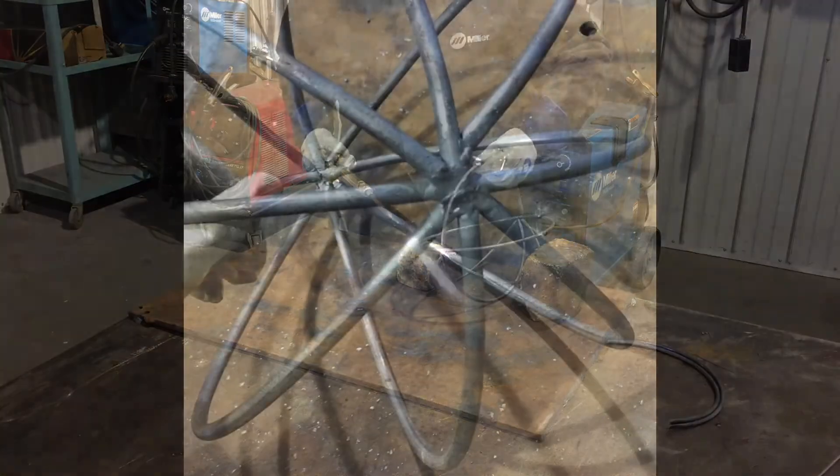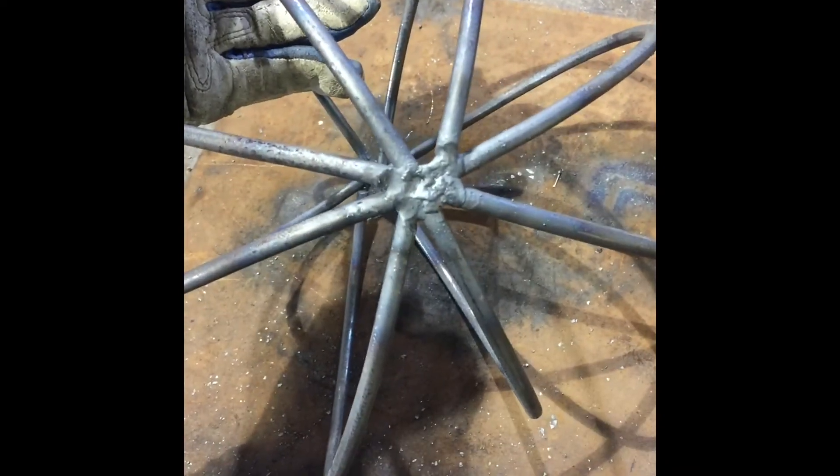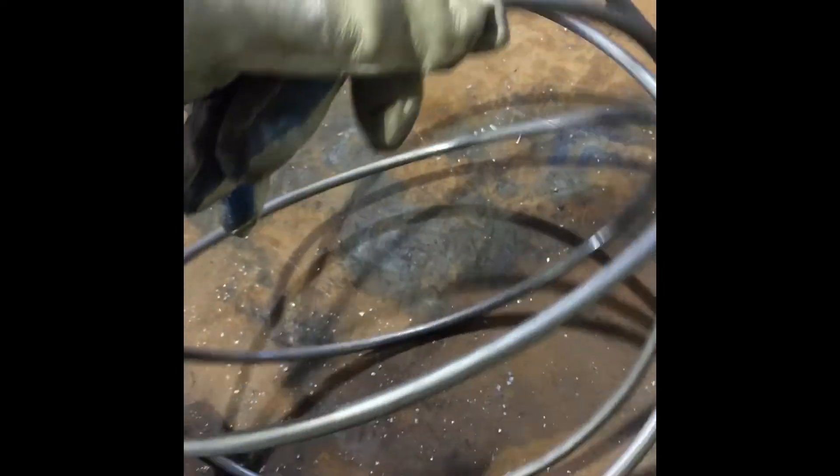You'll notice that I did not finish the inside of the welds. Spheres are pretty strong as-is because they have so many points coming together, but if you want it for visual purposes or for extra strength you can definitely weld those insides. And as with our other shapes, when you're confident it's looking good, you're going to toss it. Listen for that lovely ping sound that means you've got good welds, and then you can put your name on it and put it on the shelf with your other geometric forms. I'll see you next time.